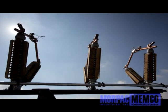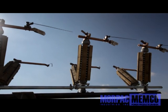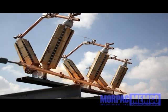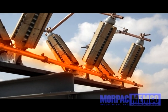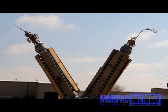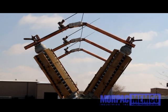Assuming you have mounted and installed all three phases of the switch and aligned them correctly by making sure they are parallel to each other and set at the same position laterally and are fully closed, the installation of the interphase pipes that connect the three phases for operation to the outboard bearing crank should easily slide into the clevises of each phase. It is highly recommended to insert the interphase pipes while all phases are in the closed position.